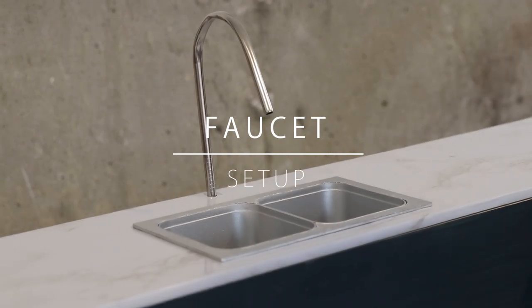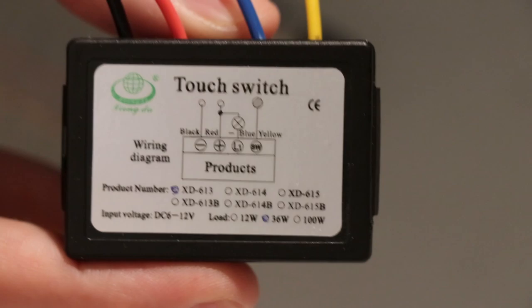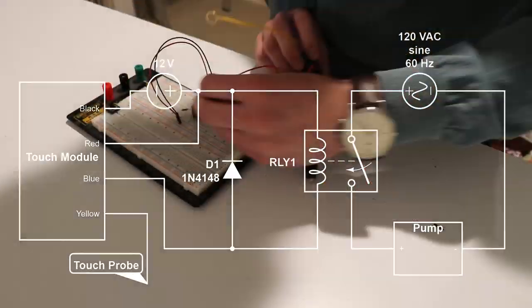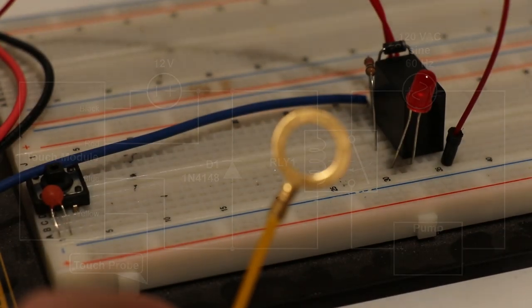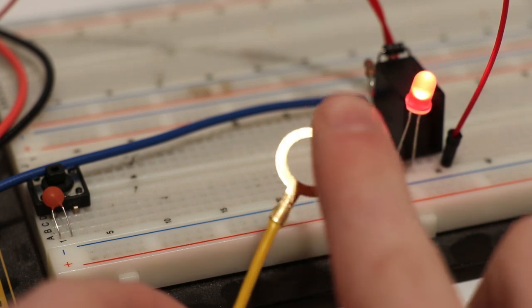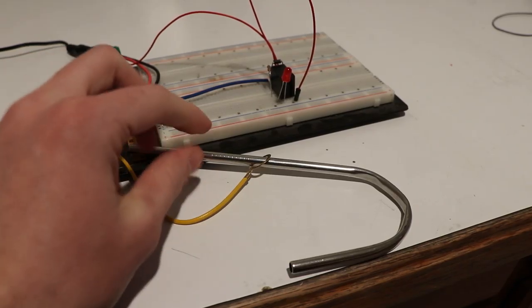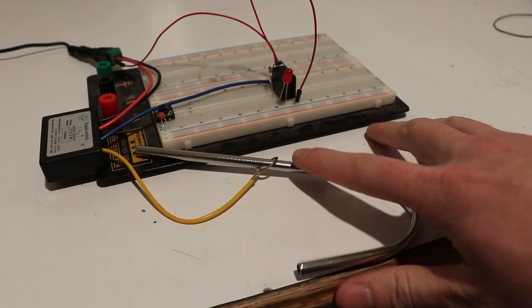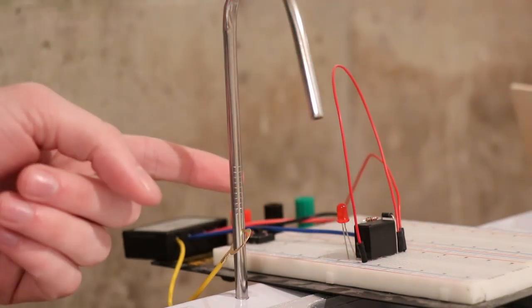To make the kitchen sink and faucet actually functional, I'll be using a 12 volt touch switch I will link in the description. Using the schematic shown, I hooked it up with a relay to turn on and off a pump to run the faucet. Here you can see me testing the circuit with an LED to make sure it is working. Because the metal straw is conductive, I can slide it through the touch contact to have the same result. In this way, we can see how it would look installed into the countertop.